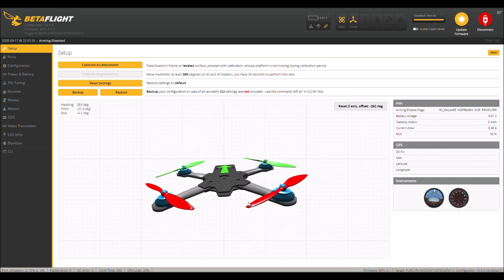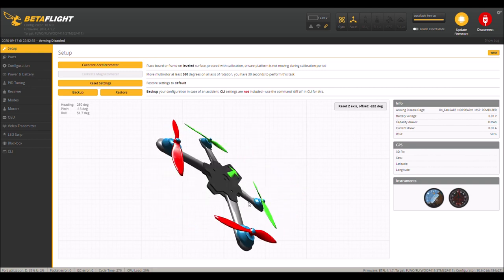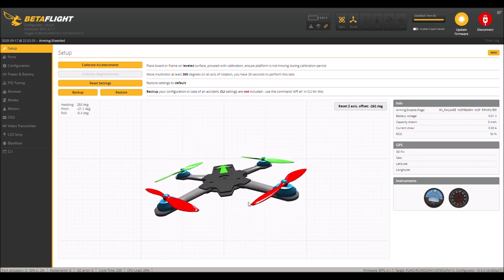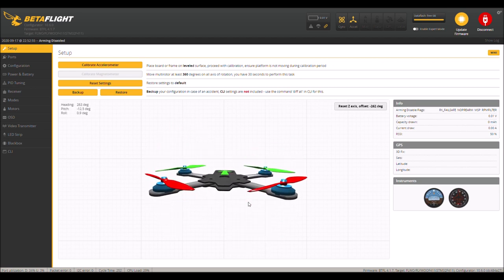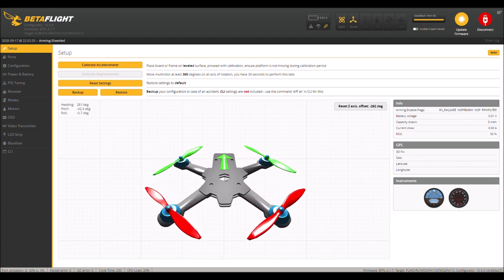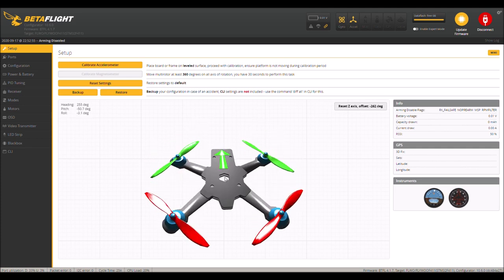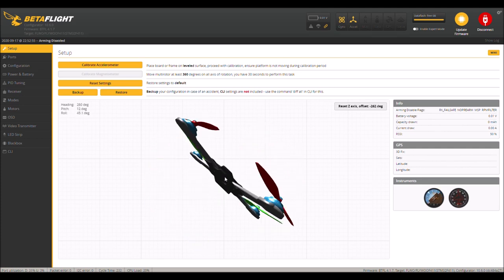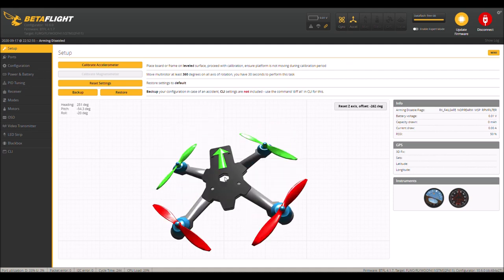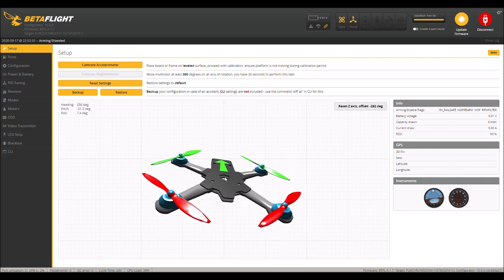Now if you're going forward and it goes like that, then you're having an issue where your board is oriented incorrectly. The silkscreened arrow on your board isn't correct. You should, at this point, before you go any further, just make sure that you have back, forward, right, left, back. Okay? And see how fast that's moving? It should move that fast.